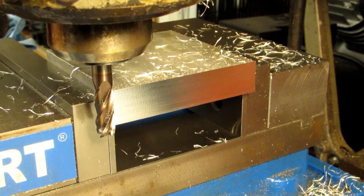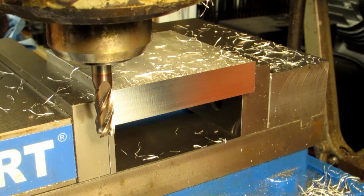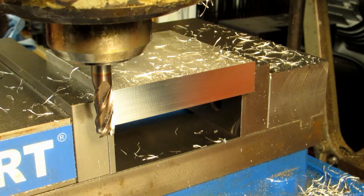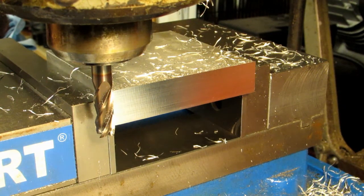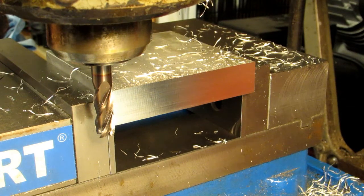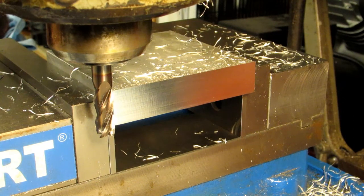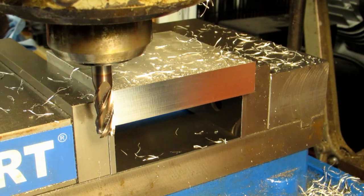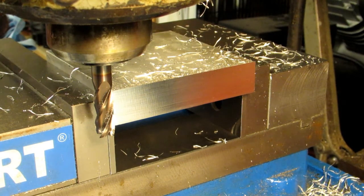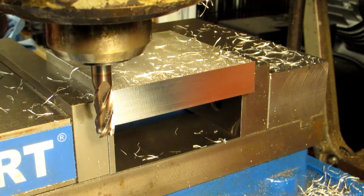For one thing, CNC machines nominally don't have any backlash in the screw — the lead screw that drives the table and the nut. You've got a very large long nut that has recirculating balls on there and a ball screw, so they don't tend to have a lot of backlash, and on a new machine they just don't have any. So you can get away with it — a heavy climb cut is not going to screw up your part or your cutter at all. On a manual machine with an Acme lead screw, there's got to be play between that screw and nut, otherwise it wouldn't move. And that play, that backlash, is what destroys things with a climb cut on a manual machine.